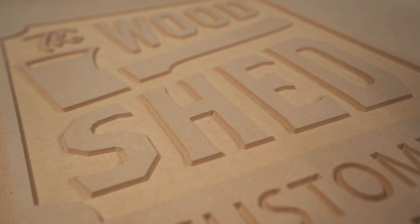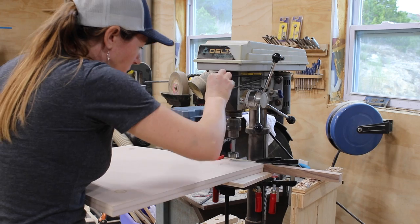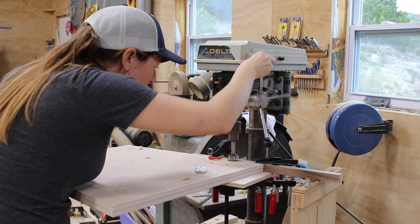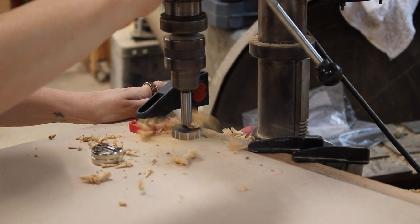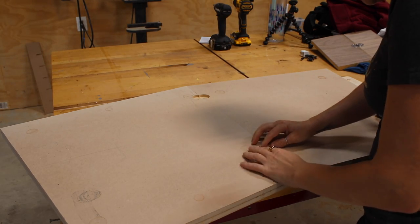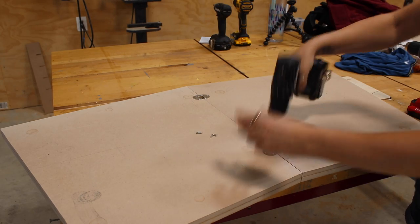To accommodate the body expanding when the doors fold out, I need the top to expand as well — and that's where these cool little flap hinges come in. They're kind of tricky to drill for because they're only a portion of a circle, so you can't use an entire Forstner bit like you can on a regular cabinet hinge. However, a simple fence at the drill press solves this issue. I set the fence so that most of the drill bit goes into the material but the rest goes into the fence, then I use the hinge itself to gauge the depth. Once I repeated this on two sections I could screw the hinges in place and test it out — I'd never used these hinges before, so I was very happy to see them work so well.